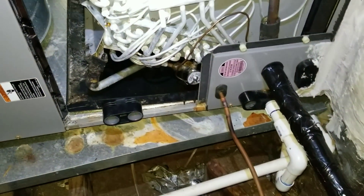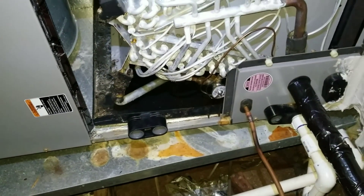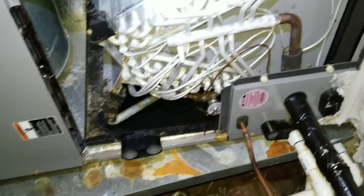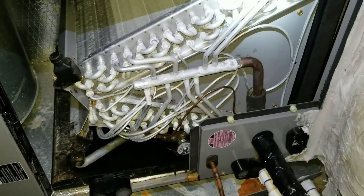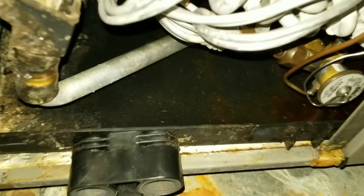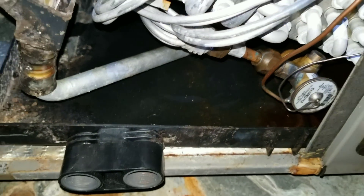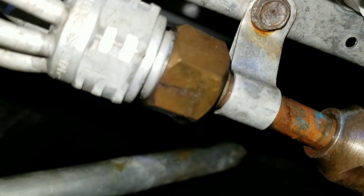What's going on guys? I was out here just performing a heating maintenance and found this system almost completely out of refrigerant. This coil was changed by another company in 2017, and you can kind of see everything is glazed in oil down there. I already took the remaining refrigerant out, but it's pretty easy to find where the leak was.